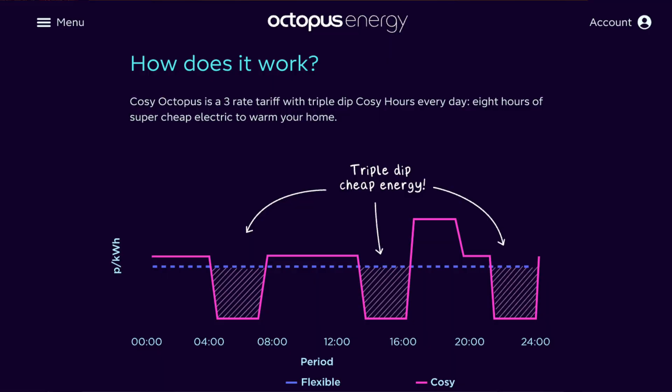Another problem with small inverters is their inability to take advantage of low-cost or free energy periods from your supplier. Let's say you can access a cheap tariff such as Octopus Cozy, where in the middle of the day you get a two-hour period of free or low-cost energy. A 3.6 kilowatt inverter can only charge your batteries at 3.6 kilowatts, so over that two-hour period you're going to get about 7.2 kilowatt hours from that cheap slot. But with a larger inverter — say a 10 kilowatt inverter — you could store nearly 20 kilowatt hours, or more if you've got more battery space. You can maximize the savings in these cheap or free periods, but your 3.6 kilowatt inverter is slowing it down.